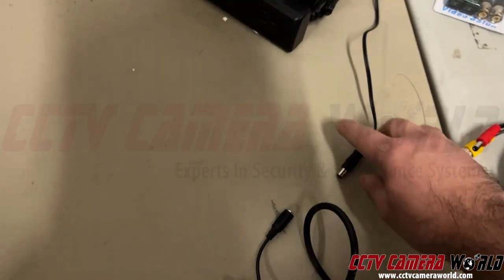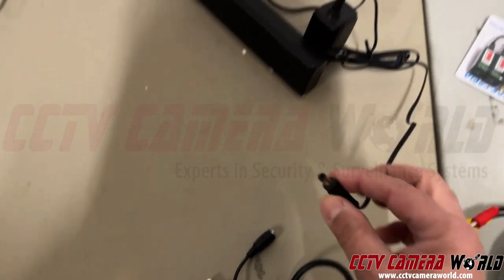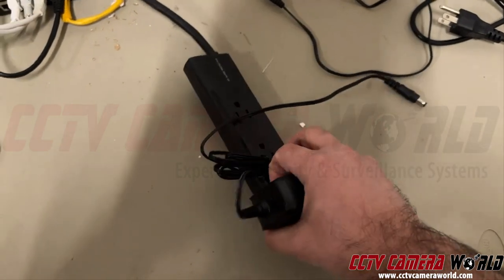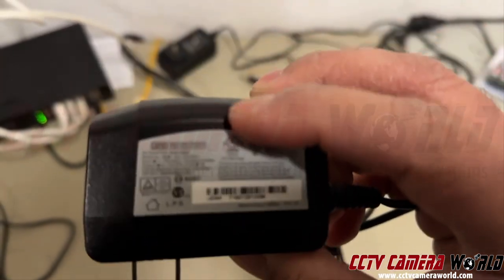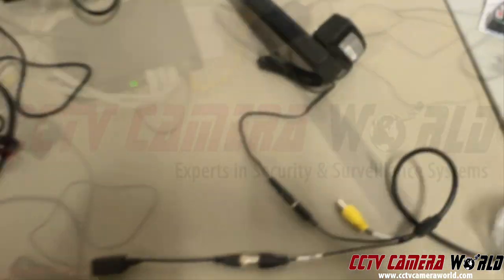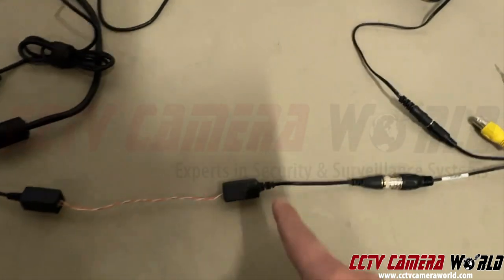You'll have to power the camera through a power terminal, which I'll show you in a second. For my test demonstrating the quality of the video balun, I have a power supply — a 12-volt, one-amp power brick. I have connected my 12-volt one-amp to my camera and connected the HD signal to my video balun.